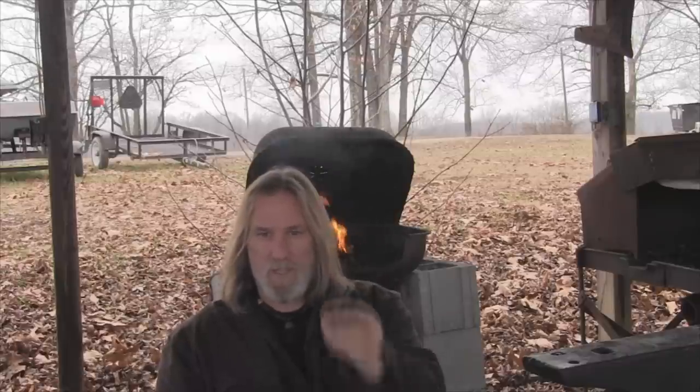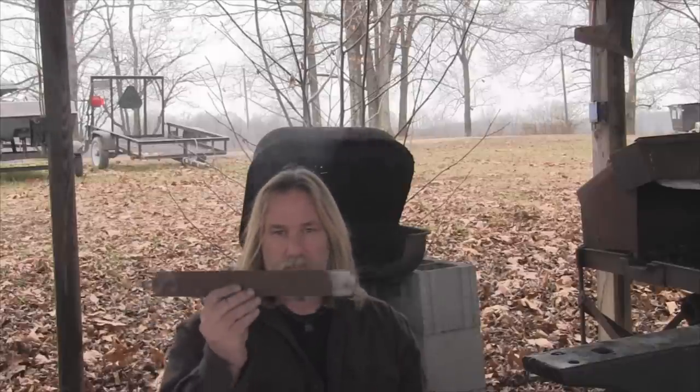Adzes were used for shipbuilding, digging out canoes, shaping timber, and digging out bowls. The adze I'm going to make is a curved bowl adze with an additional straight blade — two blades, making it a multi-purpose tool. I'm going to use an old axe handle if I can, and make both blades from horseshoe rasps.